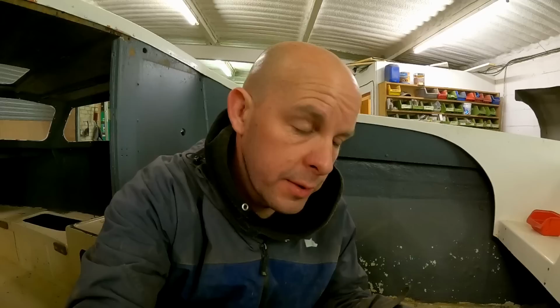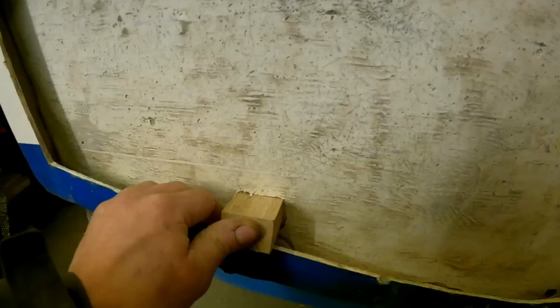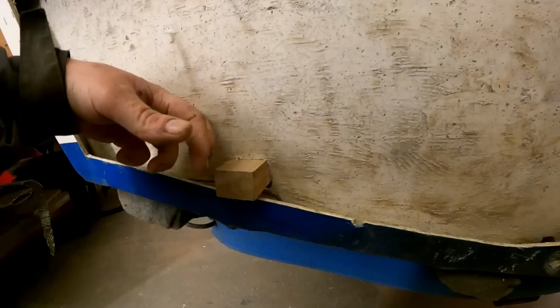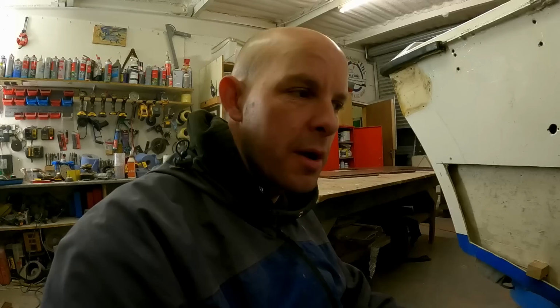So that's the ladder there. The pieces that are inside, which have got to carry the ply, basically come out at the end here. These all need cutting off now, level with this piece, so then the transom fits nice. This will go all the way in. It's just very tight. I don't want to whack it in just yet before the glue goes. I'd rather hit it in last thing. Cool. So we need to install those first, and then the transom can go on.